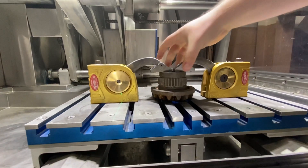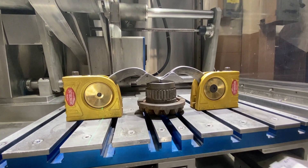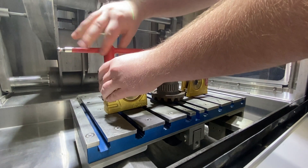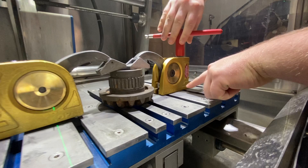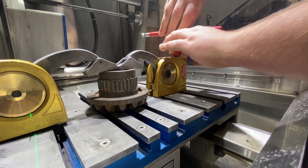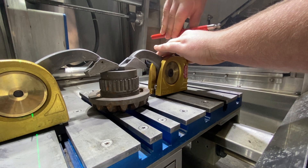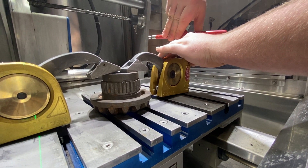But as you can see in this situation, the part can still easily move because there's still some play with the bolts. So when we tighten this down fully — and you can see it better on this side — you'll see the front edge of this vise slowly start to lift as I tighten the clamp. That's because it's coming up to meet the head of the bolt, which is the actual clamping surface.